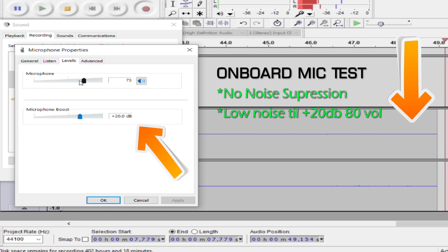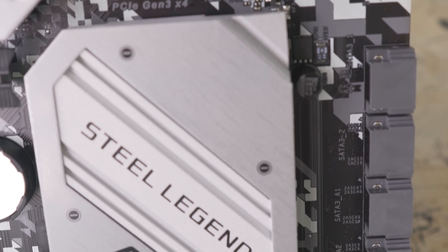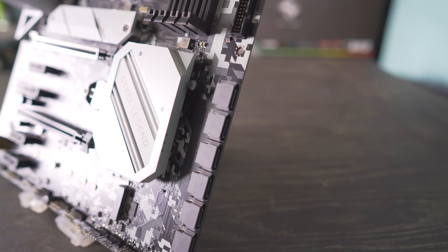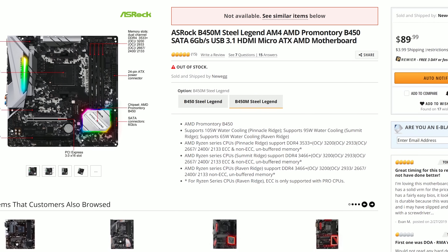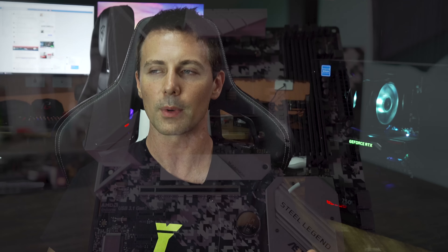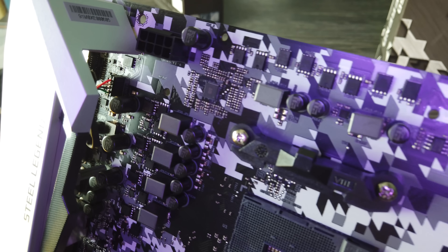If you want to stream on a budget, this motherboard is definitely one to consider. Conclusion time — the most important thing with a B450 motherboard is price and value. They've got two variants: the micro ATX B450M Steel Legend at $90 USD, which even went on sale for $80 USD, and in Australia around $139 AUD. At these prices it's a solid board — everything checks out, and you can overclock. With a 6-core you'll have no problems. With an 8-core going for 4.2 GHz overclocks, you'll definitely want a fan over the VRM for longevity.